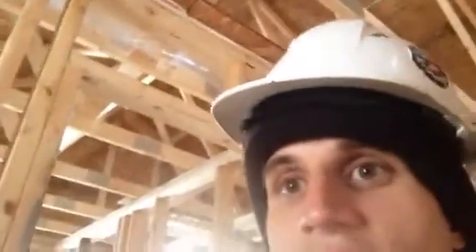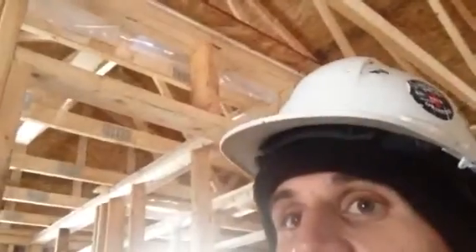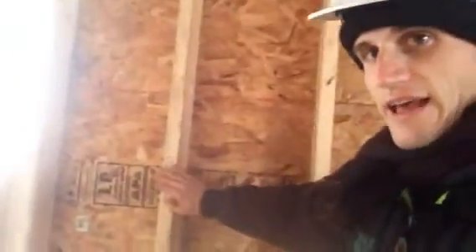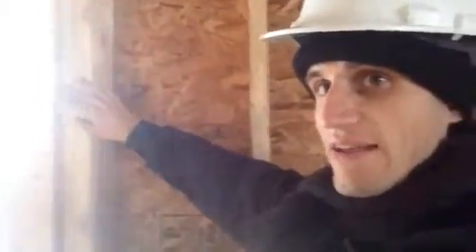Let's talk about the ceiling. Now you see here above us, there is some poly sticking out of either side of that wall. There's that plastic there because our poly has to come up the wall, the outside wall. Here let me get out of that window light with all its glare. This wall here is going to have to have poly coming up and down on top of the insulation, and it'll join to this stuff that the framers put behind the wall to tie into.